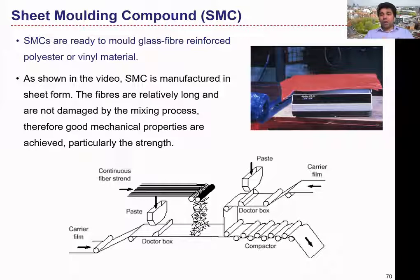So we manufacture the sheet molding compound including reinforcements in the ratios that we need. We can then cut the sheet molding compound into the required length and shapes, and use it immediately or store it for a later stage. If you plan to store the sheet molding compound after manufacturing, you must ensure the required storage conditions — particularly the temperature — because otherwise the resin material could cure before being used in the actual product.